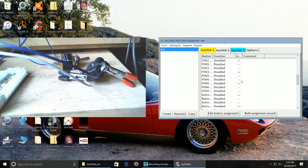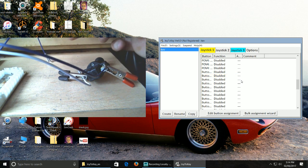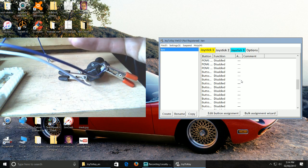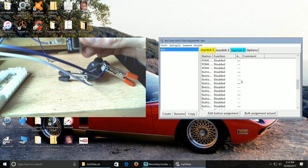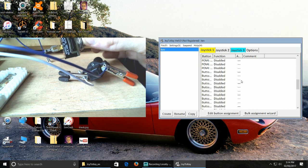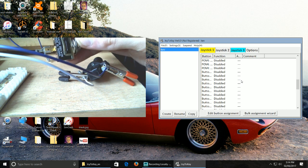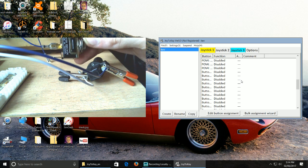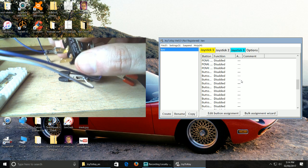And then if you come down to the buttons here, you see none of them is activated. Now here I'm going to demonstrate two things which are quite handy, a couple of different ways that you can have this. Like I said earlier, this switch is a single pole double throw switch. Like I said, it will work on the other switches as well. As you can see, I've got this wired up so it acts as just a single throw switch. So when I go to throw it in this position,